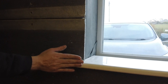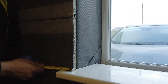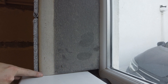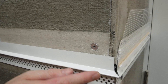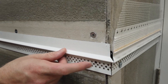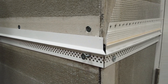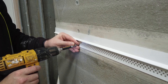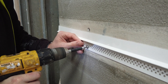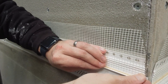Be sure to follow British Standards when choosing seals. They should protrude past the face of the render system by a minimum of 35mm and past the reveal line by 25mm. Fit the seals first before applying the boards to the reveals. At floor level, leave a 15mm gap in the system to allow for contraction in the ring beam. Our ProWall slip joint detail is affixed over the gap and rendered both sides. Fix the metal section of the slip joint with the SH3 timber frame screws. Leave a 10mm gap between the mesh and metal sections of the bead for contraction provisions.